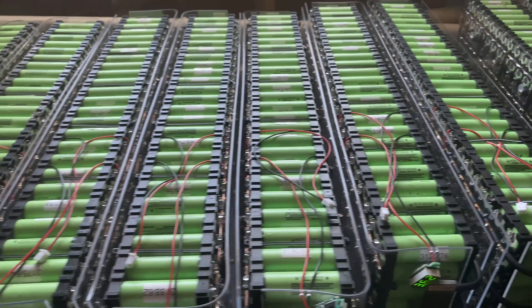The side panels fit perfectly. There's a little bit of space in between but I'm not going to worry about that. To mount the 10-kilowatt pure sine wave inverter from Aims, I'm basically going to put two-by-fours going down here and here — the rack behind it will hold it. It also lines up perfectly with the second unit. I already measured it so I can put something through here as well for extra strength, because the inverter is 150 pounds. I looked up this server rack and it can hold up to 2,000 pounds, so I think we're fine.